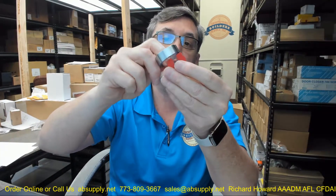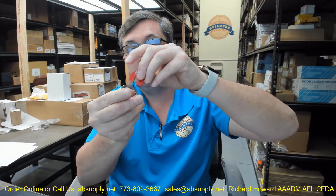This is in the 626 finish. That does mean that it's not only satin chrome with a brushed finish, but it's also made of solid brass — it's not magnetic. 626 and that part number specifically means it's made of brass. I have no reason to question that from Schlage, that this would be made of brass.